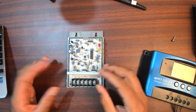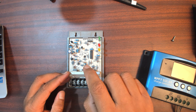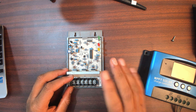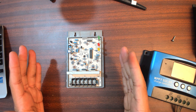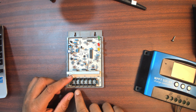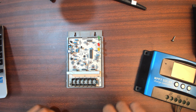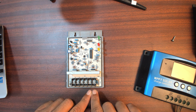With that said, this is what it's made for. There's no buck conversion, no boosting - nothing of that sort. All it does is the PIC controls the PWM output to the battery and to the power output to give an average of 14 volts. It has a point of full efficiency where the PWM is near 100%, and that is when the voltage from the solar panel is 14 volts. At that point it opens the drain and lets all the current go into the battery and into the output terminal to your load.